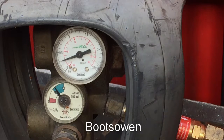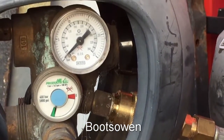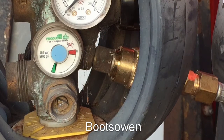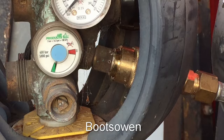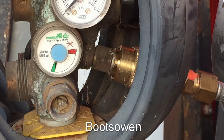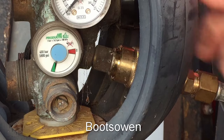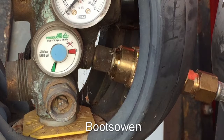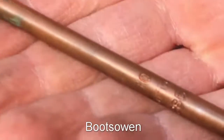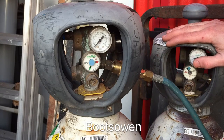This video is not about gas safety or anything like that. It's simply about these Integra cylinders and how to set the pressure on them. But for this oxygen regulator I am really struggling. Let's just open it up again — that's what the oxygen sounds like. The acetylene at four sounds less. So let's open the oxygen again and turn that off. So that's doing it by ear, listening to them — whether or not that's right, it's a number 10 tip. I've contacted Air Products because this has been going on with me for a while, but I've never thought to ring them, and I have done that now.